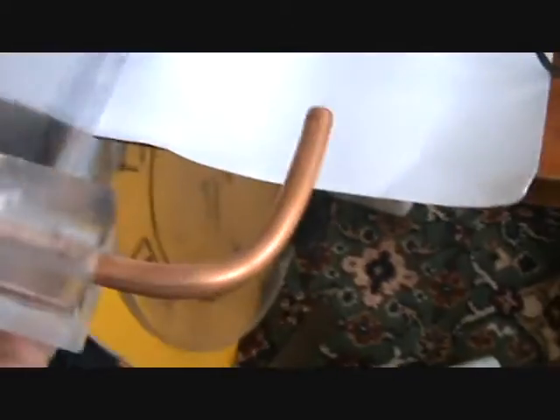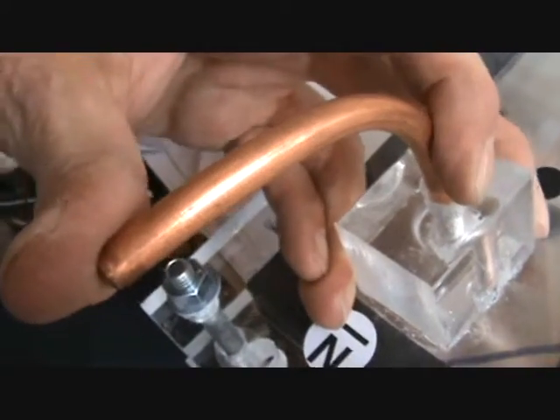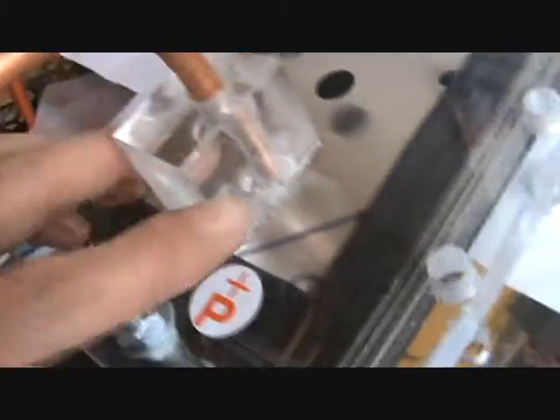There are the gaskets that I was just cutting out. You can see the pipe running right in, and then the hole gets bigger here - 11mm at the top. This is so I can put the mix in to seal it. The mix is only up here; this bottom part is already sealed because it's really tight. It's an 8mm pipe going into an 8mm hole.